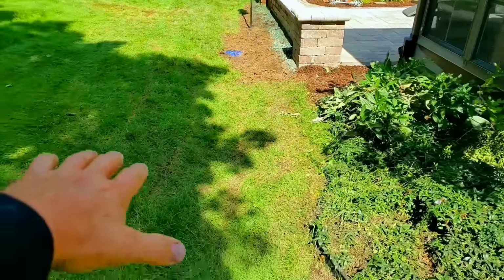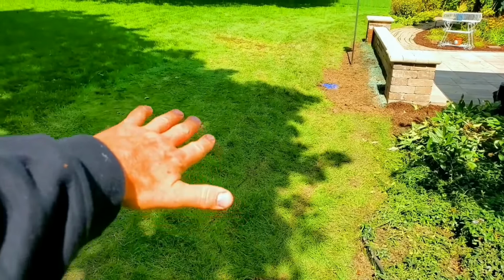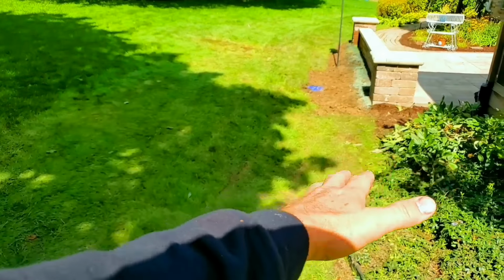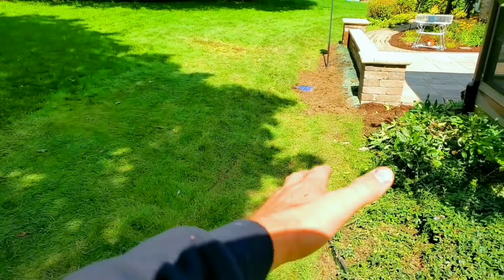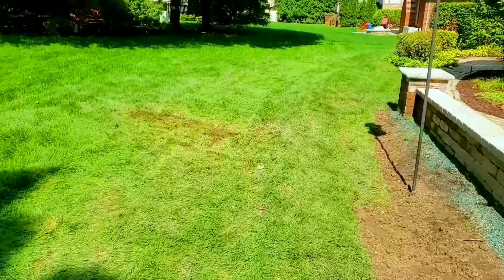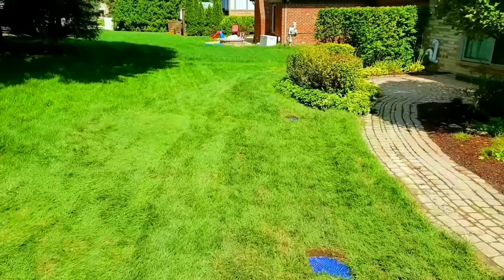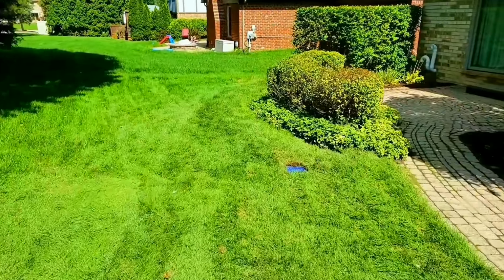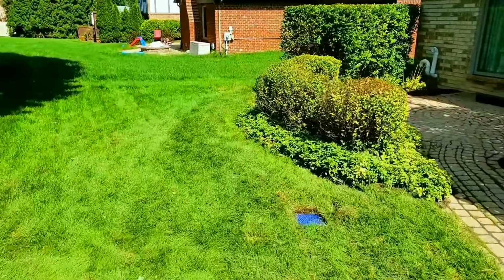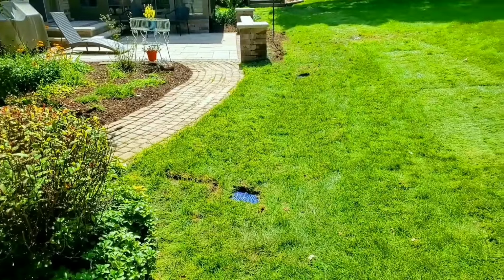And on torrential rains, say the ground still was frozen, we had a thaw, the rain would flood in here and it'd actually have that kind of motion as it worked its way draining through the blind inlets. Now once the grass grows over the blind inlets, all the grass roots are growing through the drainage fabric that we have, and to up its flow rating, we have it punched a second time.